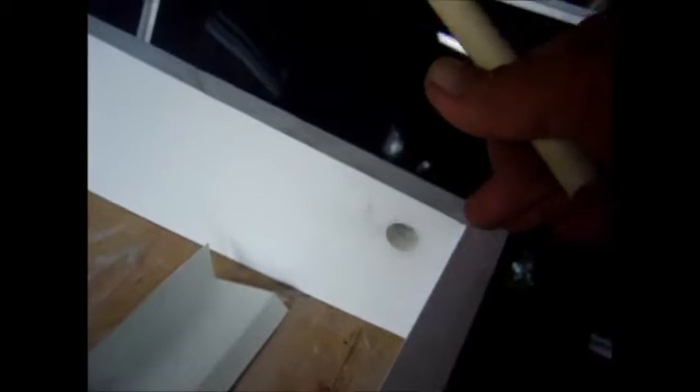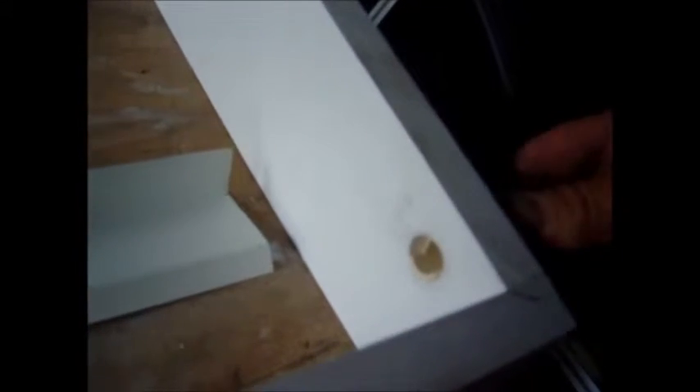I've drilled the hole and reattached the pieces temporarily to the side and front. Here's how it looks — carved out and leaving a little place on the bottom, about an eighth of an inch deep. When I put this in the hole I can bring this out, and the trough when in place will sit right in that groove. Caulking will be all around, and silicone underneath the trough lip right here. When we're ready to do the top, I'll put this in and put nails in here.